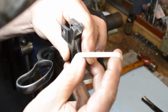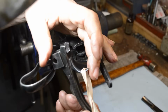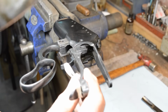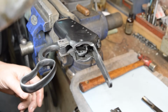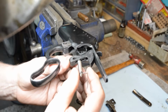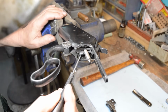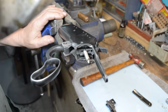Now, in order to keep this thing from getting in the way and popping out, we're just going to run a rubber band around it like that. And that will keep that spring from popping out of that cassette and leave this alone, okay? Very good. Wanted to bring that up. Eventually, this is going to wind up sliding up in here like this, and it's all going to go together. So we captured the spring tension here. We captured it, so we can feed this up inside here. So now we've got the hammer laying on top of the carrier, and all this is essentially getting lined up around the center line of that pin, right?